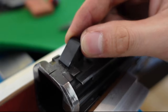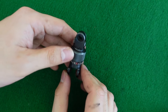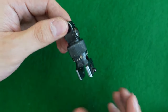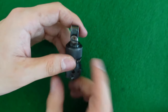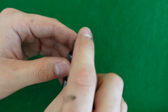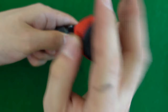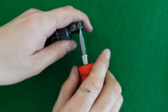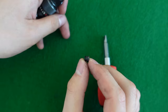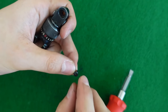Now the diopter is off. The sight base itself is firmly brazed and welded onto the receiver so there's not much to take apart there. The diopter rear sight was not really designed to be taken apart and serviced even by armorers — it's designed to be a pre-packaged, pre-assembled, fully integrated and sealed assembly. However, one thing the armorer could actually remove is the aperture insert, which is a separate threaded part in the aperture plate. All it takes is a simple slotted screwdriver bit — just unscrew it and out it comes. In case of nicks, dents, and gouges that might affect your sight picture, it can be easily replaced. A lot of aftermarket sights actually use the original thread if you want irises or filters.